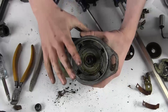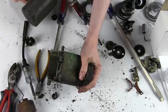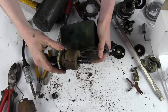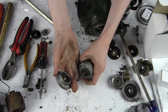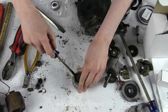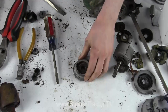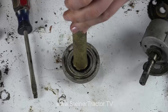Next we have our armature, which should just lift out. I'm going to tap it gently from the other direction. My armature was very corroded so I had to whack it kind of hard to get it out. You can take the bearing housing off of the end by inserting it into a vise to drive that off. Then on the underside there is a small snap ring — I'll remove that and then flip this over to drive the bearing out so that we can replace it. I do have my new bearing here; replacing it is an important step.